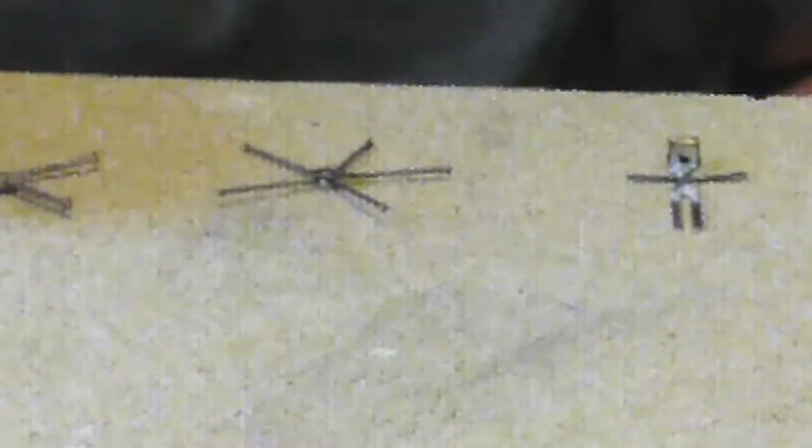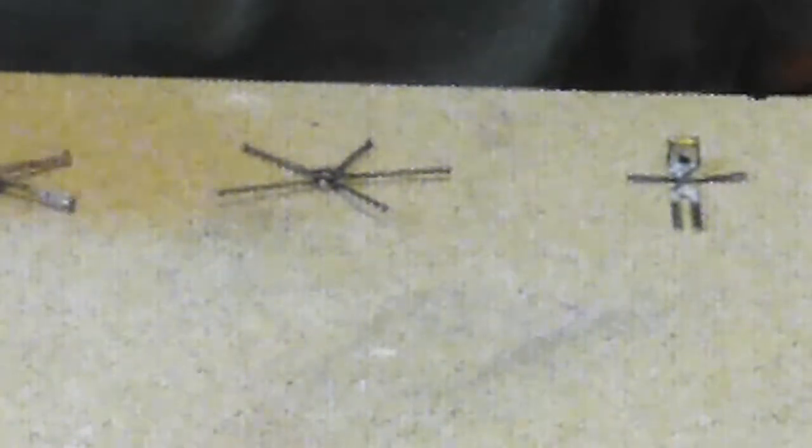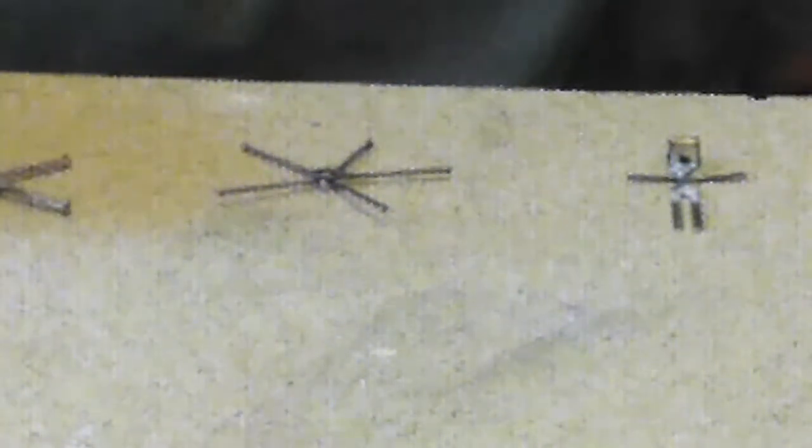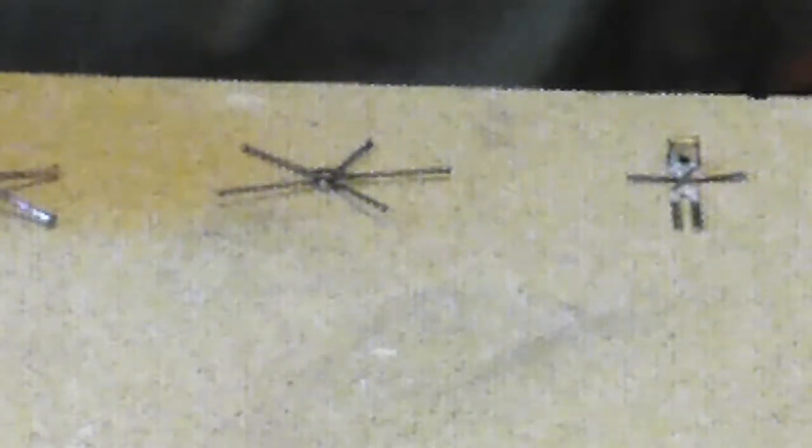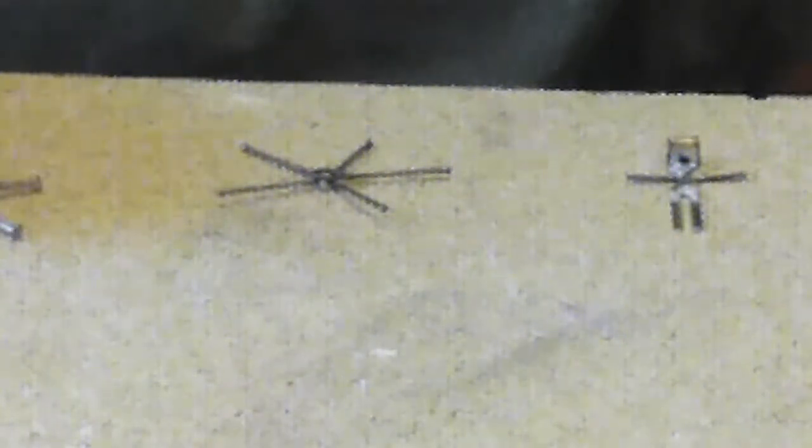So I have two different pots, and in one of them I have Sparex for my copper, brass, and silver. And in the other one I have a mixture of vinegar and salt. It's 1 cup of vinegar to 1 tablespoon of salt. And that is the pickle that I'm using for my steel.